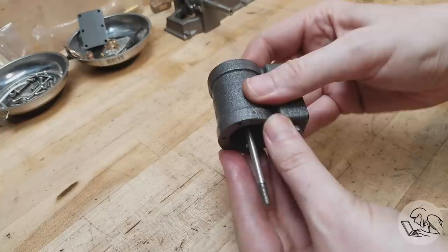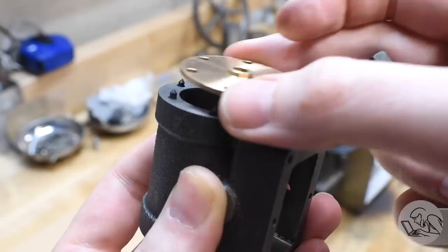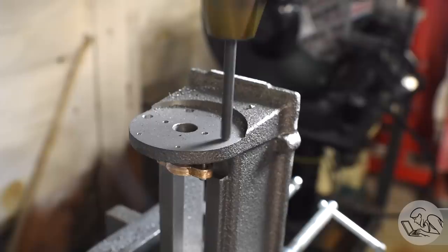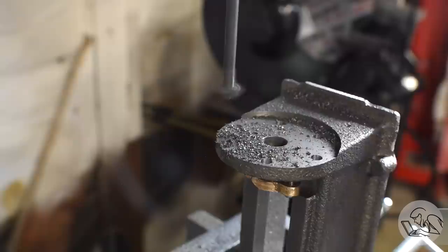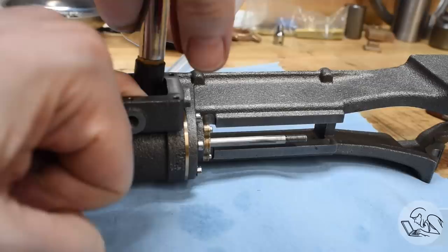It's really critical that the piston rod and bore all line up with the hole on the mounting surface on the frame — this alignment has to be very good. I ended up dry fitting everything together and using transfer punches to make marks on the frame. Not sure it was the best way to do it, but I thought physically transferring the marks with what I had machined would give a good result. I've got just enough parts now for a little air test — I can move the piston back and forth.